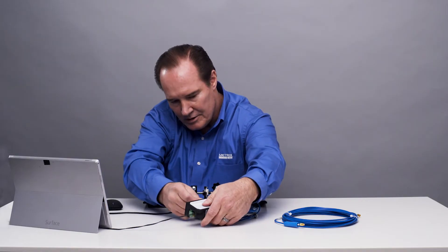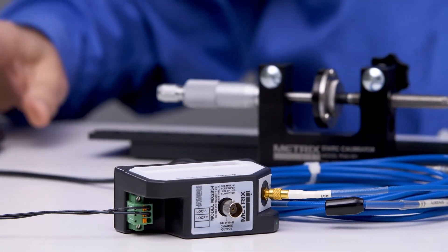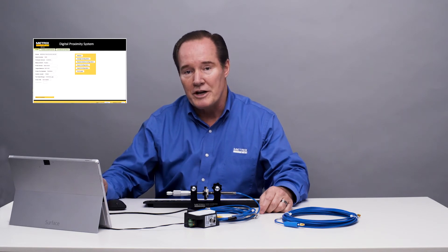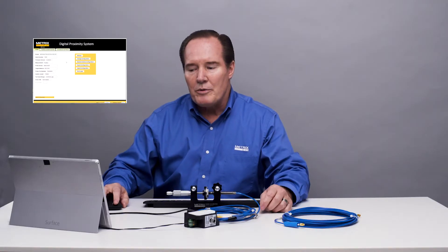I'm going to go ahead and connect to it — press that USB in firmly — and then start the software. The software will actually read what's on the DPS unit. On the MX2034, it'll bring in its transmitter configuration, which we can change, but whatever is built from the factory, that's what it comes in on. We can see here that it's an MX2034, it's position, it's an MX8030 probe tip, 4140 steel, 5-meter system, and it's presently on 10 to 90 mils. We're going to keep this configuration and see if it's linear.